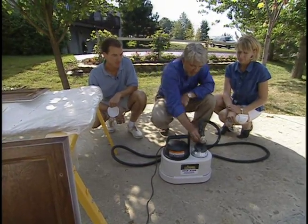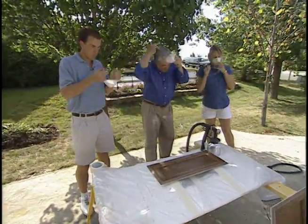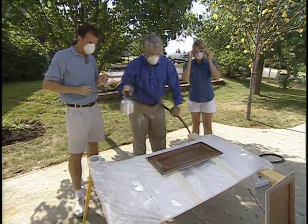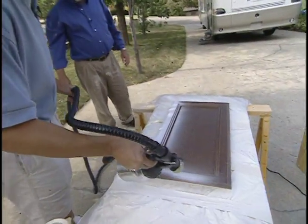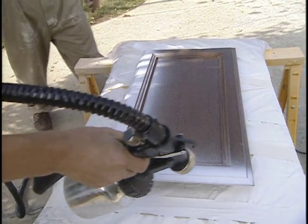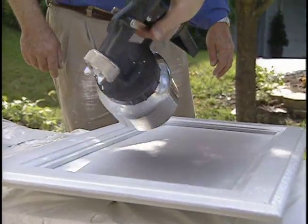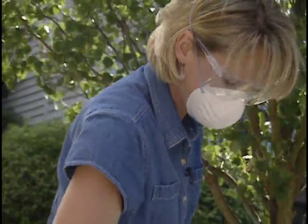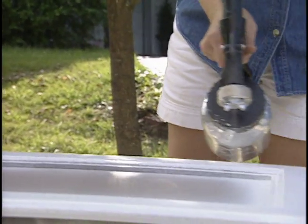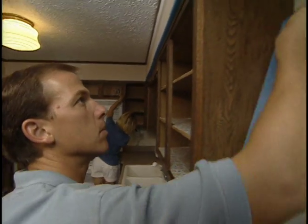To prime the doors and door fronts, we're going to use a very inexpensive high-volume low-pressure sprayer like this one right here — very simple to use. Just keep the nozzle of the spray gun about six to eight inches from the surface. We start by spraying the outside edges, making sure to keep the spray nozzle a constant distance from the surface. Next the inside edges get painted, and the interior panels are sprayed last, working from bottom to top to keep from over-spraying. I suggest taking your finger off the trigger momentarily at the end of each stroke.